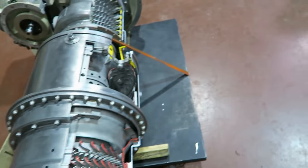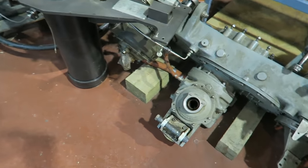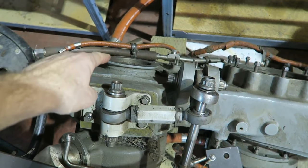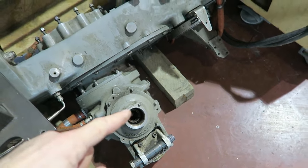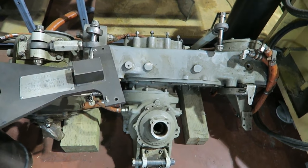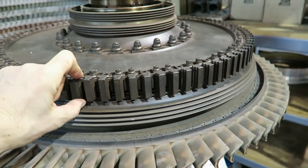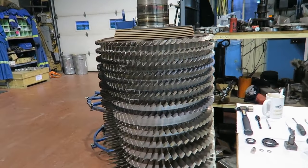Speaking of radial drive shafts, let's look over here to the LM2500 gearbox. The shaft isn't there but that's the spline driven by it — the starter would attach here. The gearbox drives through an angle drive up into a transfer gearbox, an angle drive gearbox in the engine, and that's what drives the main rotor. The main rotor consists of this turbine assembly — those are the second stage blades, which are missing — that's part of what gets turned by the starter, and it's also attached to the compressor.